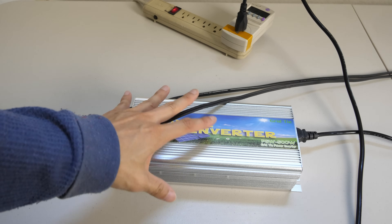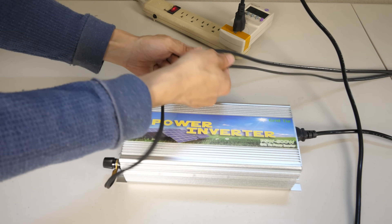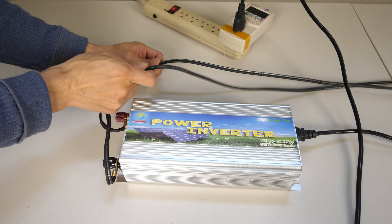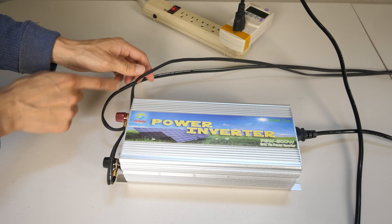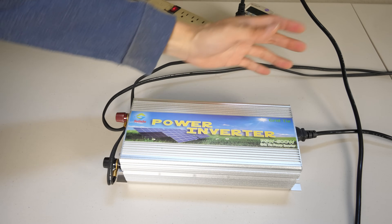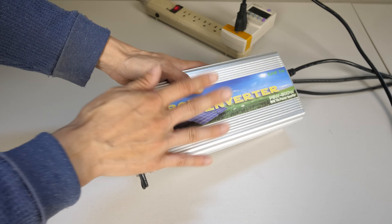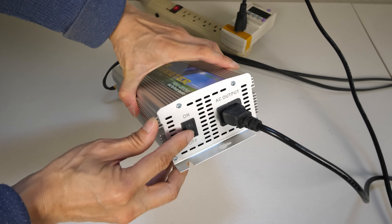So here's the setup — it's really dead simple. Over here are the power cables coming from the solar cells, two cables. I doubled them up so there's half the resistance. This is the positive terminal, negative terminal, and there are actually two panels wired in series, so it's a 24 volt system. This is a 500 watt grid tie inverter. You can see it's powered on green right now because the solar cells are active and it's feeding power back into my wall.